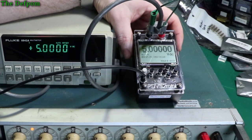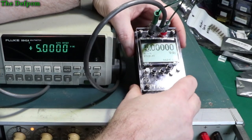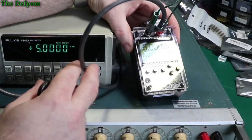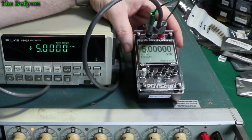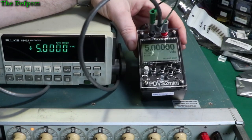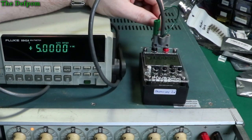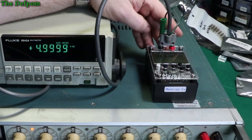In a pinch, if you need to quickly check something after a warm up period, you could do it I suppose. But I turn the power supply off and it stabilizes — probably a bit of EMI from the supply, or even wiggling these cables around can affect readings. I thought I'd show that plugging it in isn't the end of the world, but it is recommended against. You should just run off batteries. And if you've got a power supply coming in, you could potentially introduce noise into the unit — which you don't want, since it's supposed to be generating precision voltages. Running off battery, you won't have noise from the source.